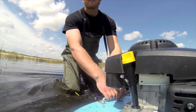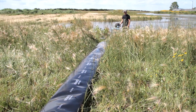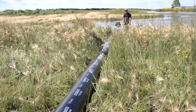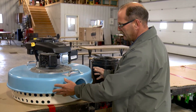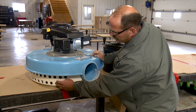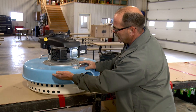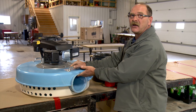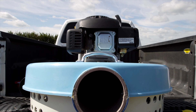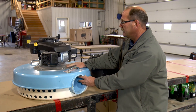The Watermaster is equipped with a five-and-a-half horsepower Kohler engine. Greg says they've kept the design of the system as simple as possible. The housing serves as both the flotation device and the housing for the pump — two in one. The inlets for the water come in here, and it floats about an inch below the top, which fills the whole cavity with water, making it self-priming. As soon as you put it in, it fills with water. The impeller is inside the housing and is connected to the transmission, which is a four-to-one gear drive connected to the motor.